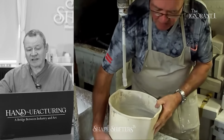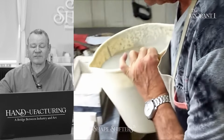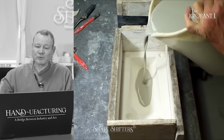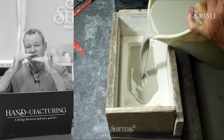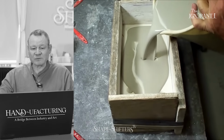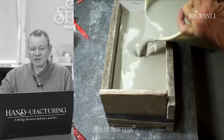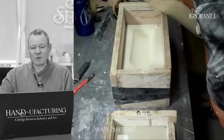It's a very, very dense material, but most people tend to pour it too soon. You have to mix it for almost 10 minutes before it seems to incorporate itself. Otherwise, the mix will separate. The ultracal settles and the water rises to the top. So you want to mix between, I'm going to say 6-8 minutes. 10, longer is okay. And this is with room temperature water.